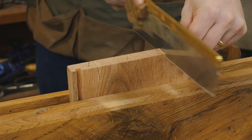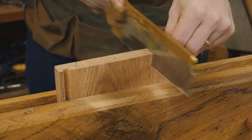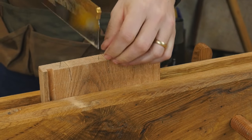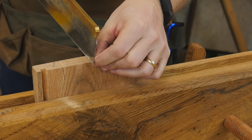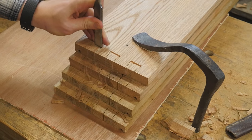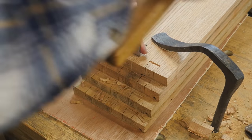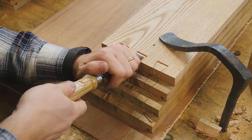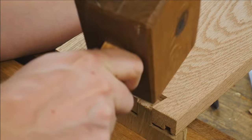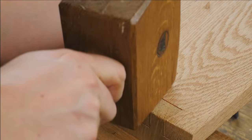I love using a 45 or 55 to make these grooves — it just makes it a lot of fun. On to the dovetail work. I did a lot of dovetails on this — 40 joints. I actually made a couple videos on how I do dovetails. It's all freehand, it's all organic feeling, and it's a fairly quick process when you think about hand tool joinery. After working them all out, I can make sure that they all fit and that every drawer works well together by itself.